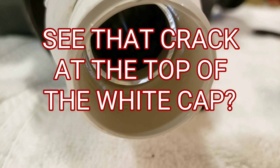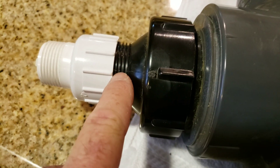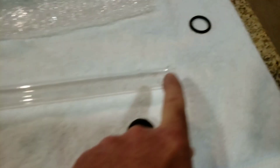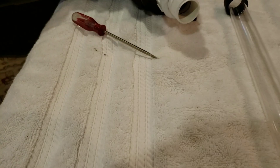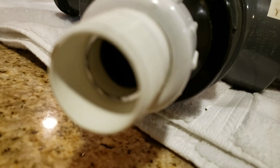I've been able to adjust the sleeve on both sides. As I continue to tighten these guys down on both sides, that's going to bring them into each other. Again, this is hand tight — we don't want to over-tighten it because if you over-tighten it, you're going to end up with another crack. Both sides are hand tightened down and we're lined up about a quarter of an inch on each side. That's close enough.